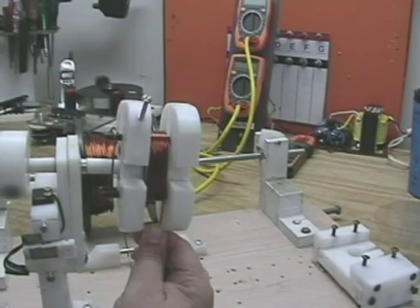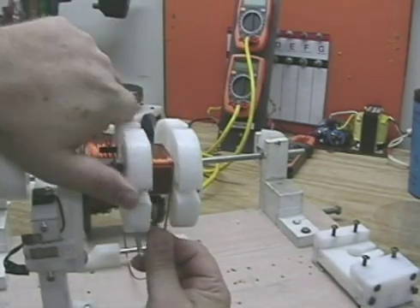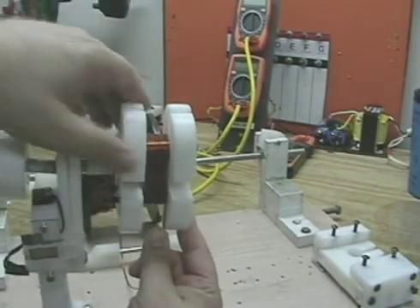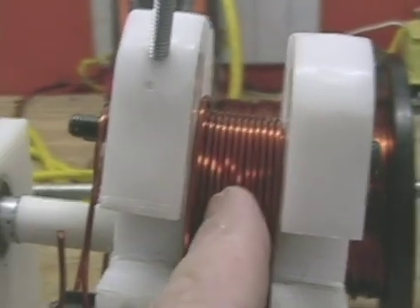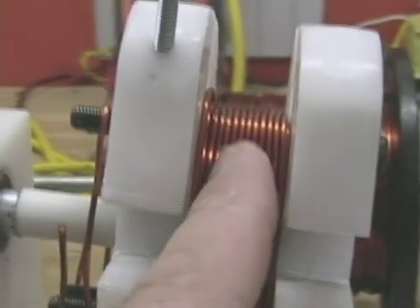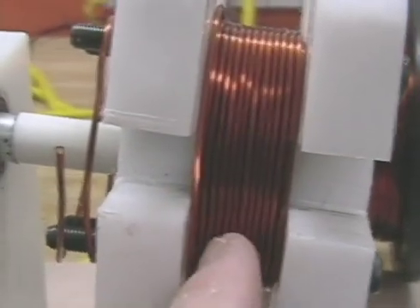So basically this is 13 wraps and it has to fit — on this coil it's 13 by 8. That centerpiece is designed to be exactly 13 and it's an extremely tight fit at 13. So when I get to 13 here, that last wrap fits in there very snug. The first round was 13 wraps from side to side, and then once I got that in there real tight, I put superglue on the outside where the coil started and ran it across in a couple places. This wind is on top of those streaks of superglue and I only do this on the first and the last one.